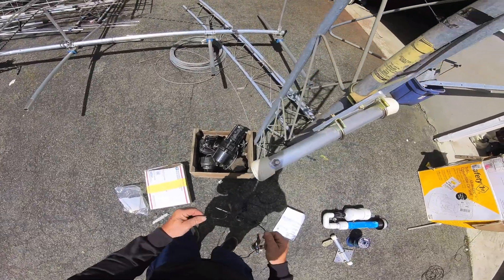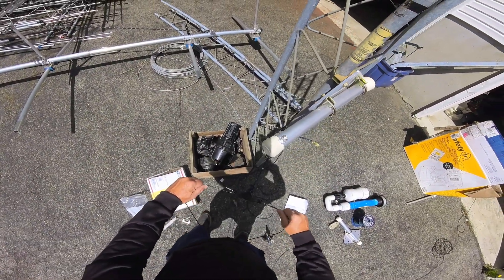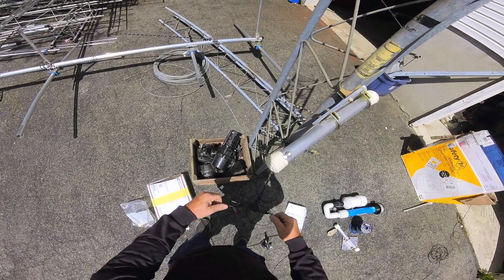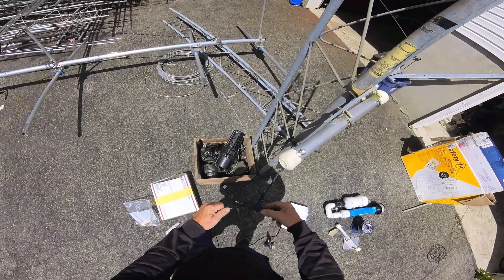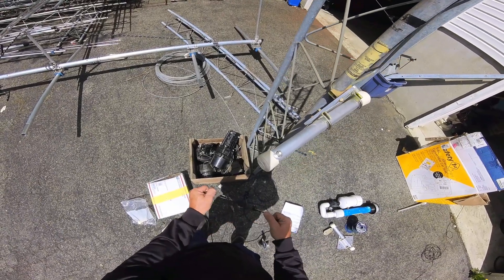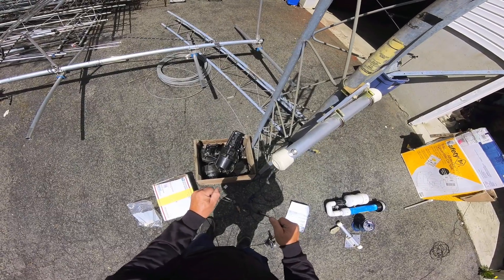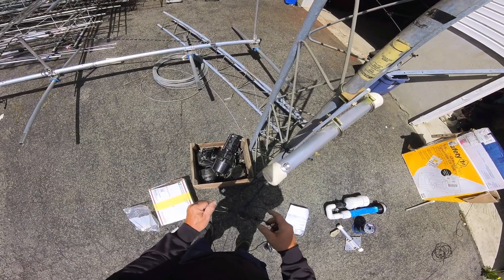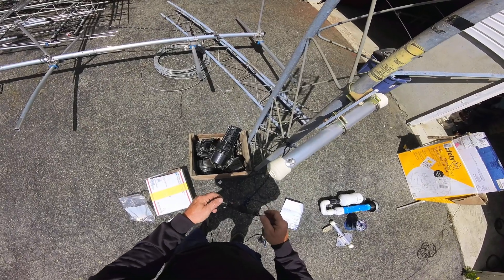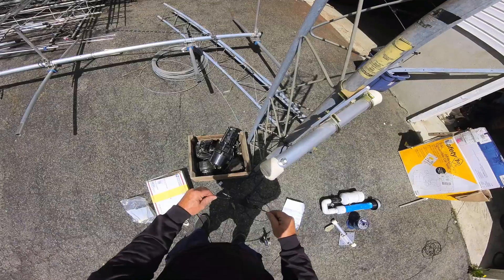Come on over here — you can see when this thing is up in the air and I'm pulling on it, it's not pulling on the two posts. It's just pulling on the plastic part of the Budwig. And this is strong — I've had these up for a number of years. I do the knot trick: you want to take the strain relief off. You don't want any strain on the post itself or the wire there. So the knot's going to hold it in place.